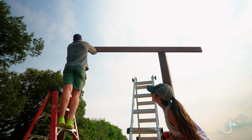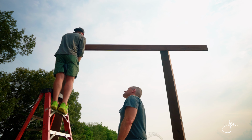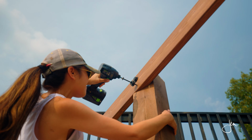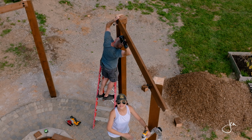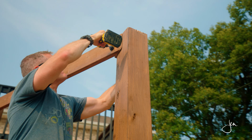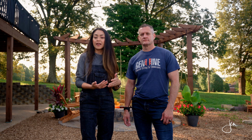And while they sadly don't make a connector for this specific application, because it is super niche, I knew I could use my favorite Outdoor Accents hardware because they're structural and they look great. When I drew up the plan in SketchUp, the angles at the top came to about 30 degrees, so at least I had a jumping off point. Then, on the job site, we cut a prototype to ensure that the angles were right.